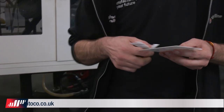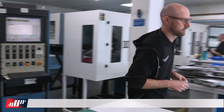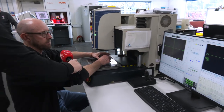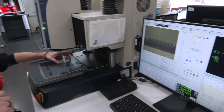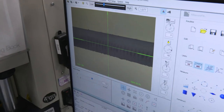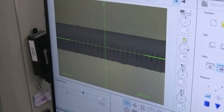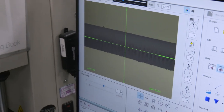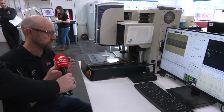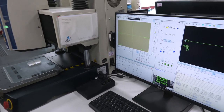So what actually happens once you've snapped them? We need to get the right depth of scribe, so we come onto the OGP and we measure the depth of the scribe from top to bottom. Normally it's around 33%, but on this job they want 60%, so I've had to go quite a bit deeper. The deeper it is, the less shear you'll get on the edge of the plate.